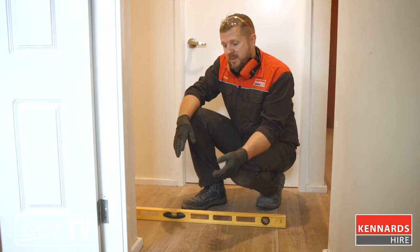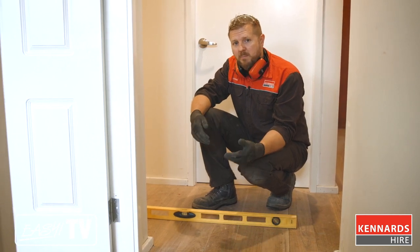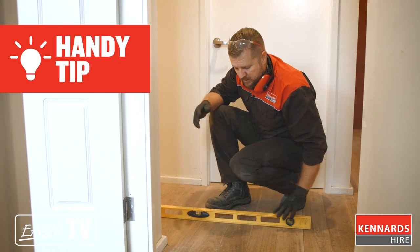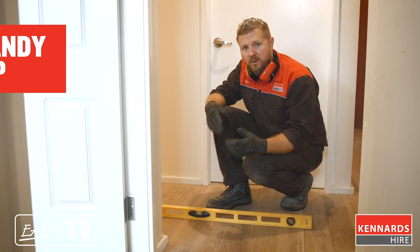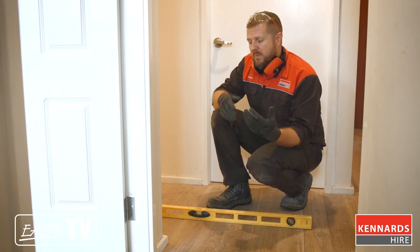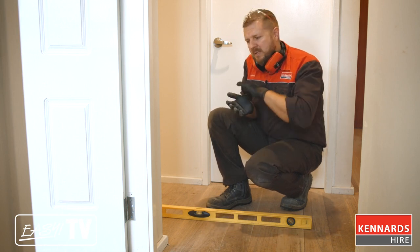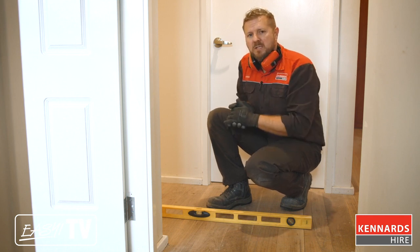As we touched on earlier, this is actually new timber floors, so it's not so much an issue here. But if you happen to be preparing an older timber floor, some of the floor boards might actually be warped or cupped. In that scenario, the handy tip is to run a straight edge across them to get a real visual indication of whether any of the boards are warped or cupped. If they are, your first pass with the floor sander is to run at a 45 degree angle — that way it's going to help take off the top of the high spots before you get into the proper finishing steps.